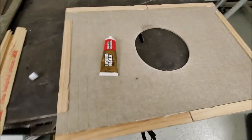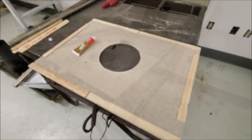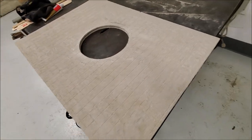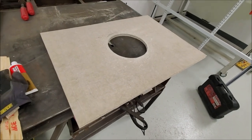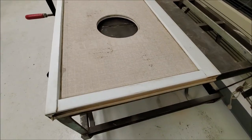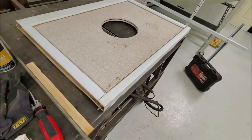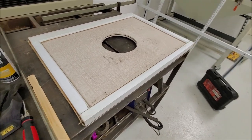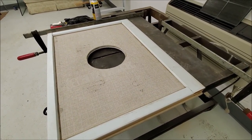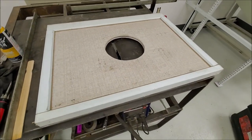We've got all our spacers glued down now. We'll put one more thin layer of liquid nails and bond the next section on. And there's our assembled unit. Now we will put the window gasket around it and slide this into the window frame. And there it is — a finished window wood stove pipe thimble. I think tomorrow or the day after we'll get this put in and lay the pipe through it, get the bracket up on the side with the T section and put the chimney up. Turned out pretty well. This definitely could have gone worse.